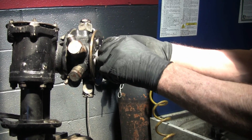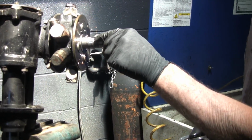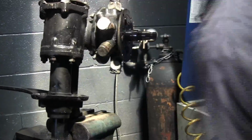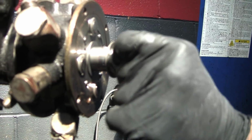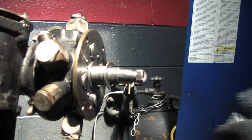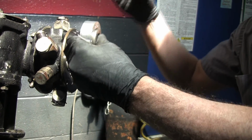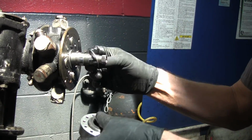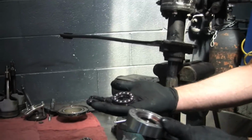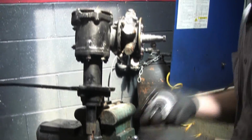Okay, so you can see where that washer got off center. That washer is supposed to fit over this, and then that other plate bottoms out on this shoulder. So that washer, along with all the other washers, once we get in there, we'll see the valve, hold that valve in a very particular spot, which centers it on this housing. Then you've got some roller bearings, because this shaft, you don't want it to move back and forth too much. It's got to be held in a pretty good position.